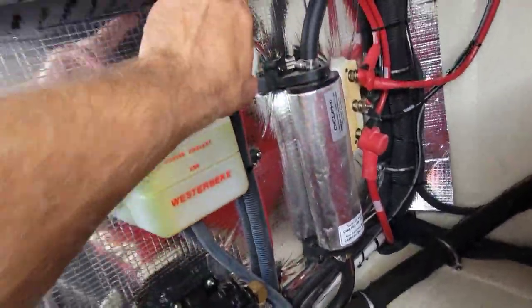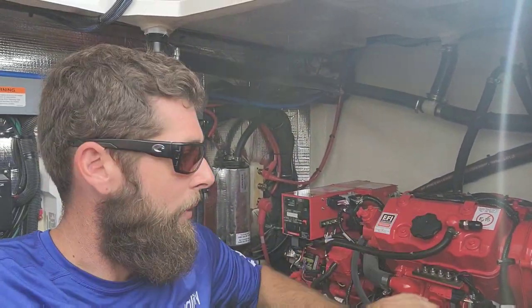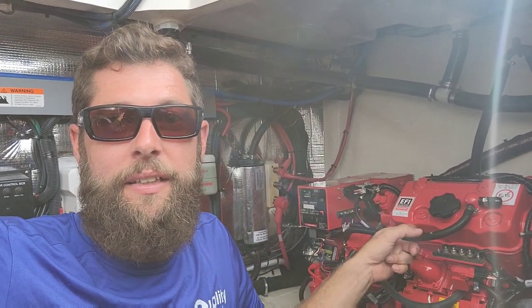If you look, our power wire goes all the way and it's shared to our house side. Because this thing is shared with the house side battery, if something fails the generator is not going to start. So what the customer wants to do is add just its own battery - isolate it by itself - so no matter what happens, in an emergency situation this thing should fire up and be able to help out the boat. Kind of a good idea.